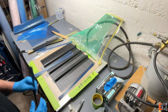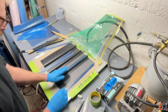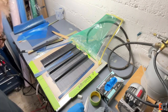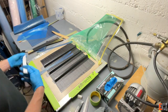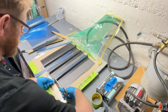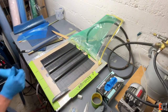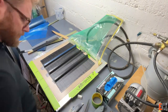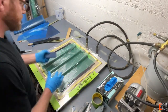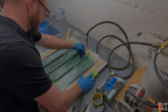And these little strips of uni are essentially a capping to go on top of the little beams formed by these stringers. And I'm just stacking two plies here. It could be substantially neater. And you just did things like this, want to offset the edges ever so slightly so that you don't end up with steps. And stacking these up and going to give it a quick debulk using all the extra bag and hammering it in there with that rub stick.